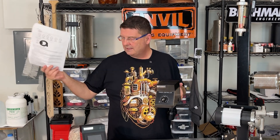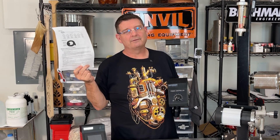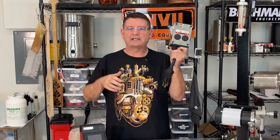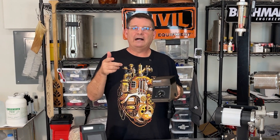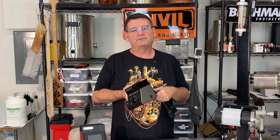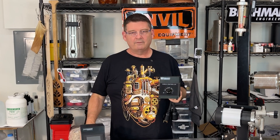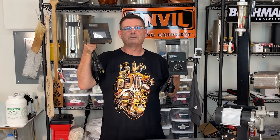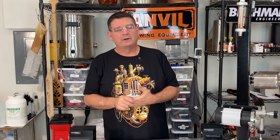One thing in the specs — you can look in the back of the manual, which is online and downloadable — for 240V it uses an L6 30-amp connector, and for the 120V version it's an L5-20 20-amp. I'm not an electrician, so check that and verify you understand what you're looking for. I'm looking to do a brew where I do a mash, kick it over to the boil kettle and do a boil, while starting another mash — I think that would work beautifully. I'm wondering about the pump but I could just turn it on and off manually — not a big deal.